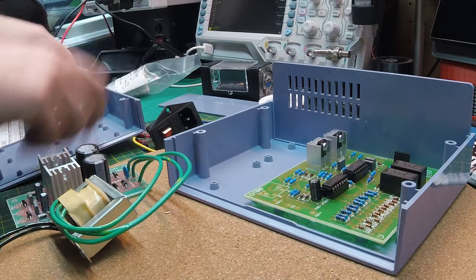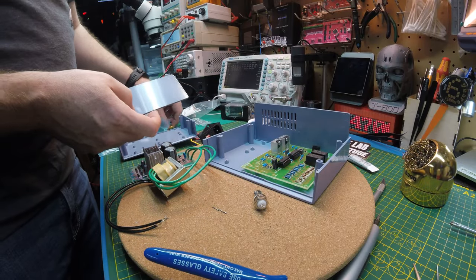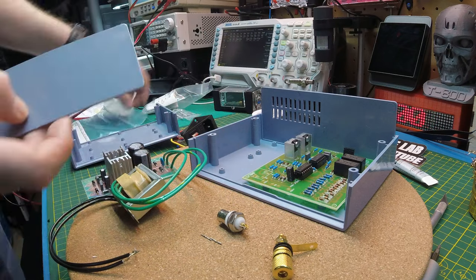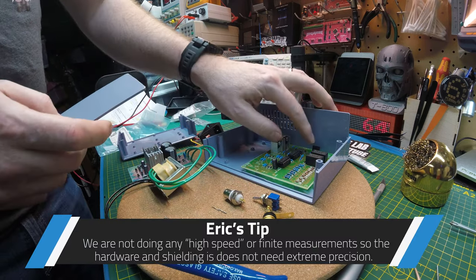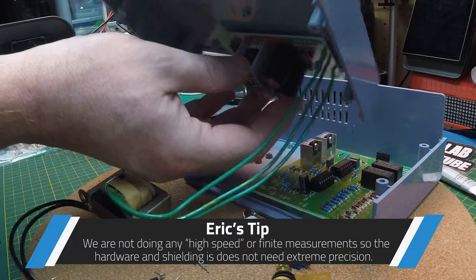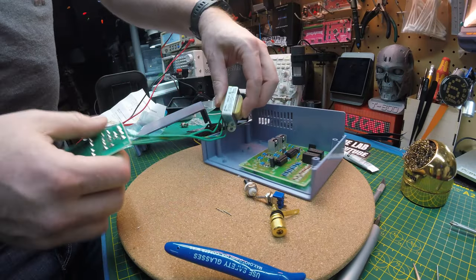And that way I can put my BNCs in nicely, binding posts, because the BNCs, they'll need to go in the front too, and switches for control instead of those jumpers back there. This should fit in the top, suspended, and I'll put the transformer on the bottom just because, well, it's heavy.